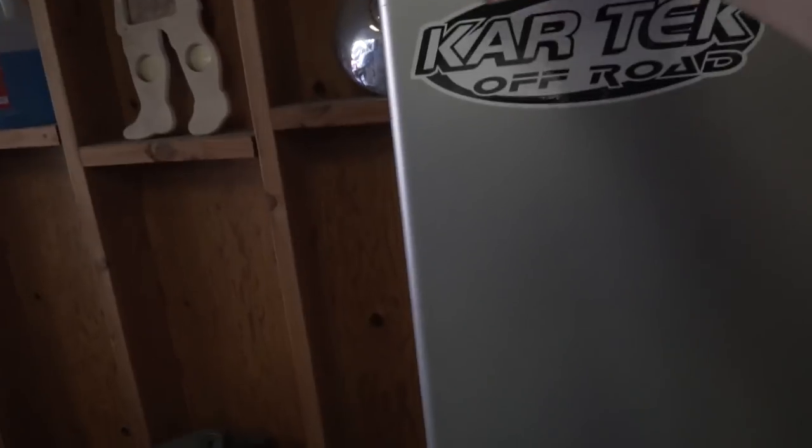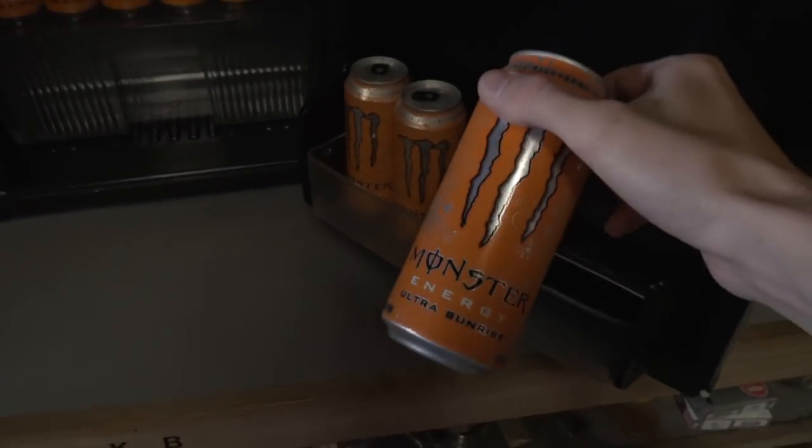Welcome back to the channel. In today's video we're going to be working on Jerry the '64 Bug. In the last video we got the front beam cut and turned and lifted the car, so that's all back under the car. Today we're going to change the brake lines because the ones on there are old and rotted out and too short - we can't even get all the steering angle out of the car. We also have some extended brake lines and we're going to make custom one-off tie rods. The old ones were all rusted out, and the link pin on the end was super wobbly and worn out, so we're replacing that with heims for a lot more strength. As always, we start the video off with a little Monster action - going with the orange today.